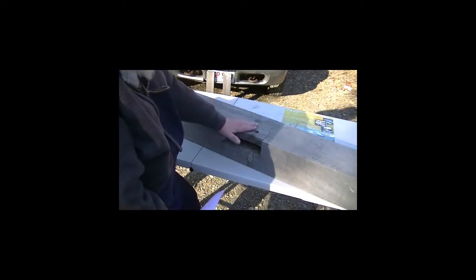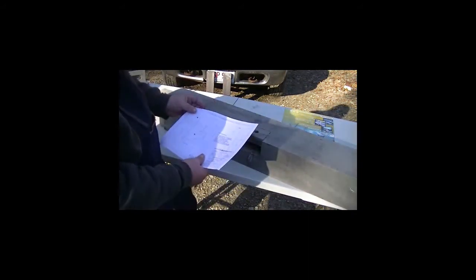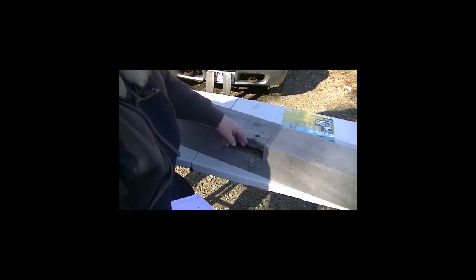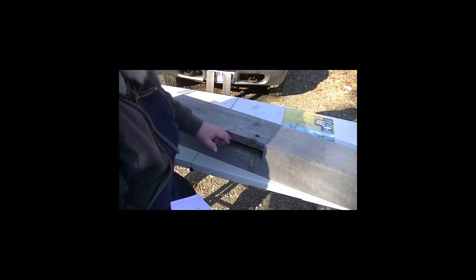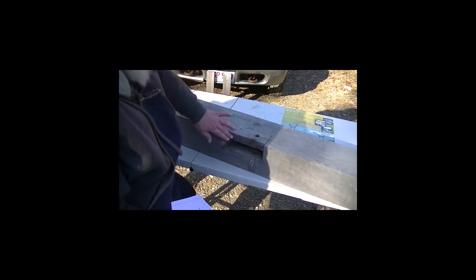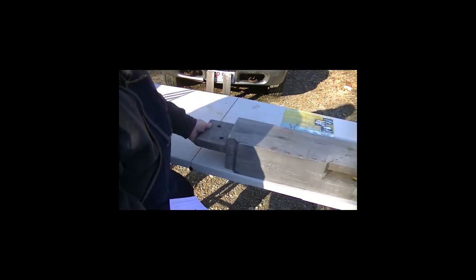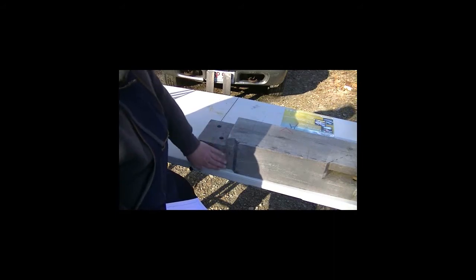This is the reference face or adjacent face. This is the reduction where we reduce this joint down to a half inch under the six by eight to seven and a half, so this surface here is that inner timber that I showed you earlier. And when we look at the end, here's the tenon — inch and a half, inch and a half thick — and here's the reduction down to that inner timber.